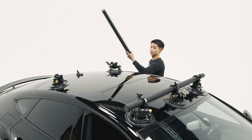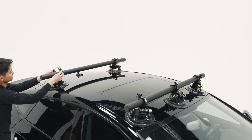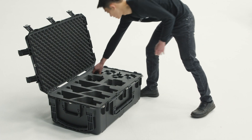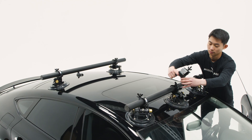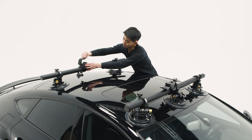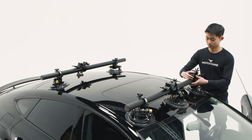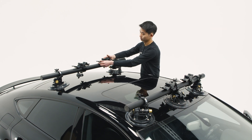Repeat this process at the rear of the vehicle, adding as many suction cups as necessary along the length of the speed rail and confirming that all fasteners and clamps are fully torqued. Remove a fixed 90 degree clamp from the SSG kit case and position the clamp on the front rail, biased towards the side you're working on. Position the other three clamps, ensuring alignment between the front and rear pairs and leaving the upper clamps open for speed rail installation.